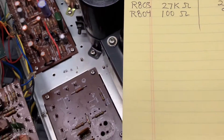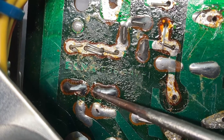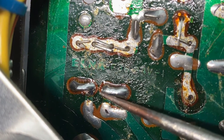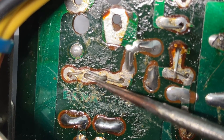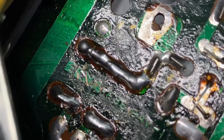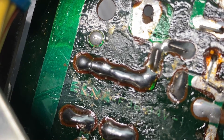I'm going to start populating the board. I just soldered in the two diodes — they actually connect to those two round ceramic capacitors. You need a space right here on the leg; you don't want that connecting, but you want them to overlap in this direction. So you're bending them to overlap both ways right there. Over here you want this one to overlap inward, and we're just going to create a solder bridge going all the way across these parts. You want a little space where they're not connecting on those two, and up here you're creating a solid connection all the way across those leads.